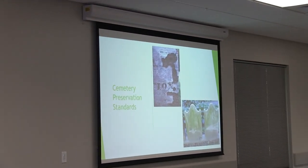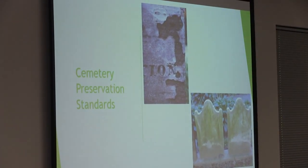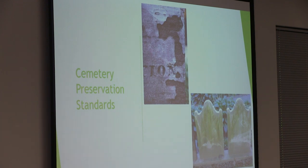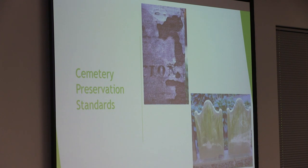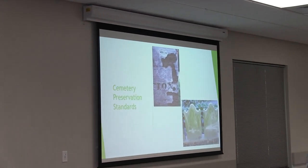What you're seeing here is damage from a water repellent — that layer built up and caused the stone face to spall off. Even old consolidants created a film like that, though newer ones penetrate much deeper and do a better job filling the whole matrix of the stone. This is another example of us reinventing the wheel. I believe in the old techniques and just letting stone do its thing. If we remove modern treatments and give stone the environment it needs, it will last a long time.